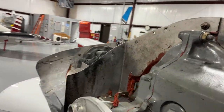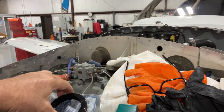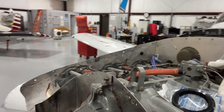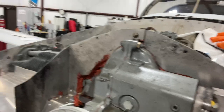We're going to look up here — there's a nose seal that actually — it's a rubber seal. It looks like this, and it actually seals the crankshaft from the oil bath in the engine. So there's pressure up there, and that needs to be sealed and installed properly.